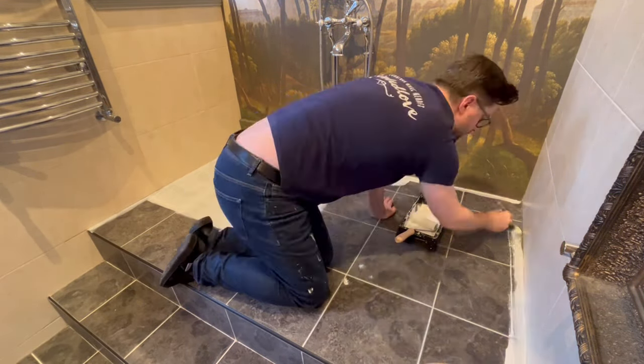I'm not going to work like that. I'm going straight onto the chalk paint. I'm going to be super careful. I've got the paint for touch-ups. Touch-ups can be tricky. You need to feather them away so that you don't have anything that shows through at the end once lacquered. Stencil pattern.